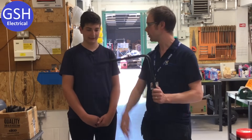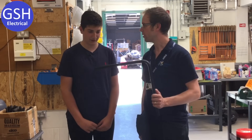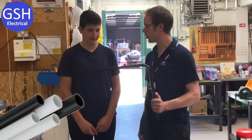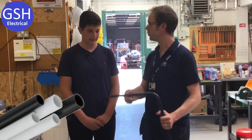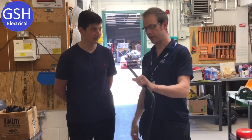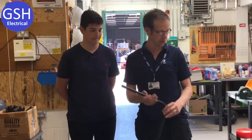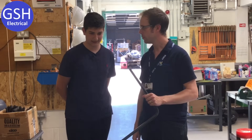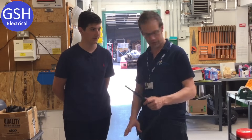So we've had our learners in for a welcome to college day today. We've been working very briefly with the lads, bending some of this stuff today. What's the name of this piece of equipment? PVC — polyvinyl chloride. And what is the actual tube called? Conduit. And it's made of PVC, which stands for polyvinyl chloride. What's the diameter of this piece of tube? 20 millimetres. Very good. What are the common sizes of conduit? 16, 20, 25 and 32. Very good, well done Sam.